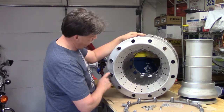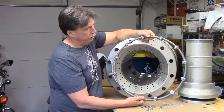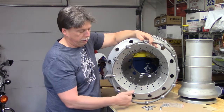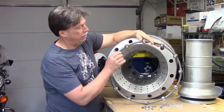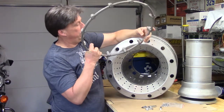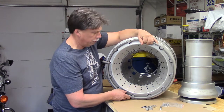These holes are obviously where our nozzles fit. If we hold this ring up — it's a fuel manifold, basically tubing bent in a complete circle. At the bottom of the engine is an inlet, and the fuel can flow either direction and probably does. We have 12 fuel nozzles which spray a big heavy fog or mist — at full power, a very heavy fog of fuel — and this assembly attaches to the combustion chamber.